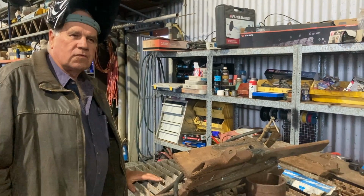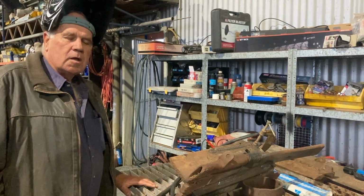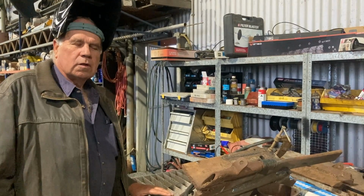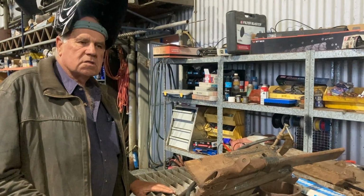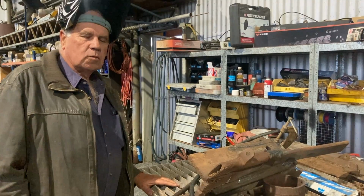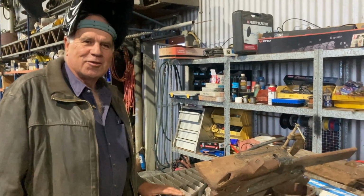Like, if you had some old rods that you want to use up, it'd be an ideal opportunity to do it. But you also need to at least allow 2.5 mil thickness of steel per rod that you put in the head, so that you increase the steel thickness as you increase the amount of rods you put into it. Otherwise, it won't take the heat, and it becomes a thermal lance in no time.